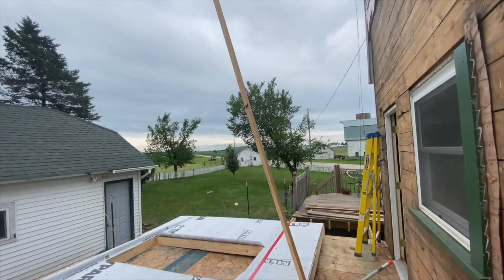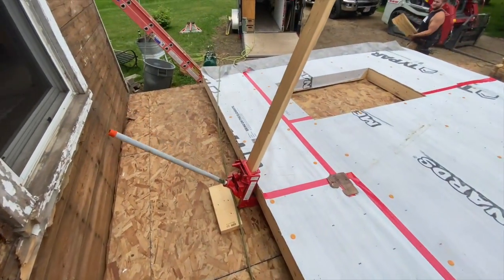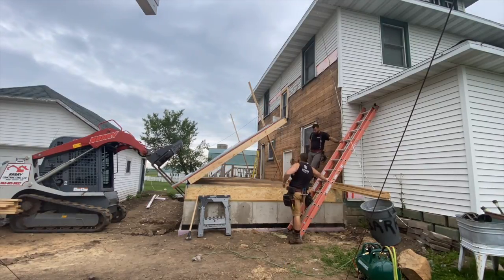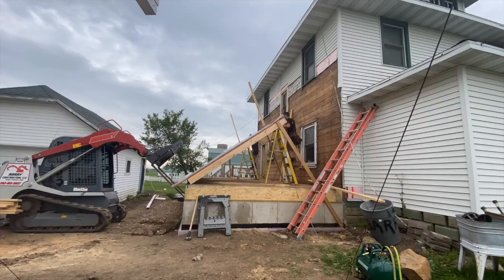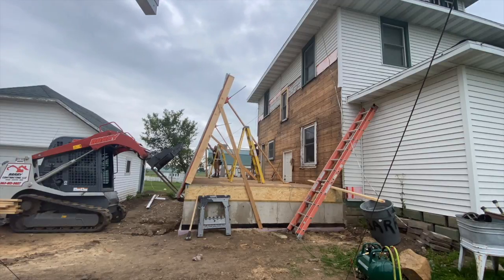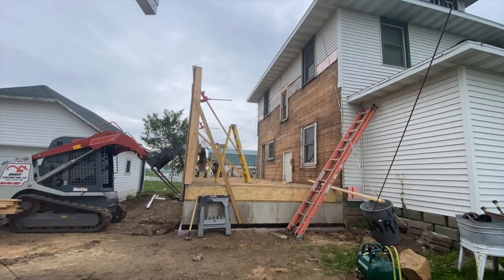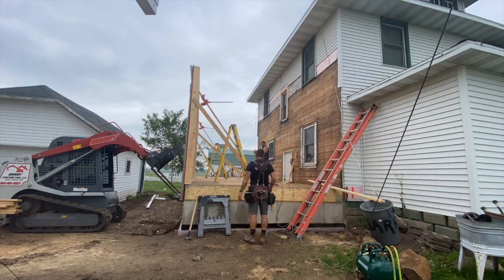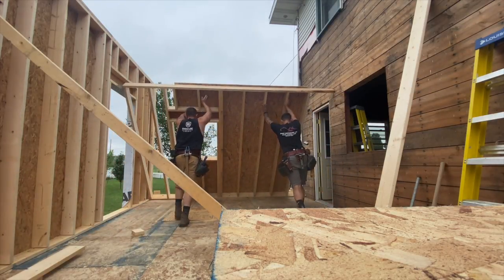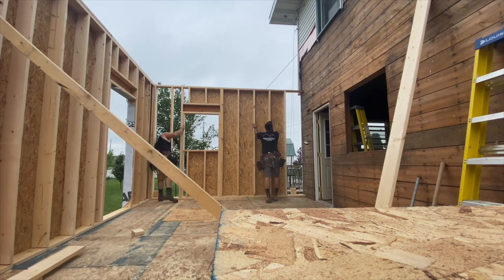It's nice that you can use some framing lumber — you don't have to have anything special for that. You just nail a block on the floor on either side and then up we go. It would just be a little too short to make a separate video on wall jacks, so we're just going to leave it in with the wall framing. We had to adjust because we probably should have had a little bit longer board, but it worked out. I also put the top there just to make sure no accidents happened. This is the more traditional way of lifting walls, but obviously these are pretty hefty, so the big one had to use the jacks.